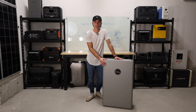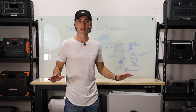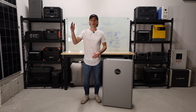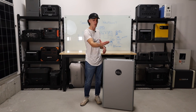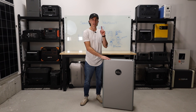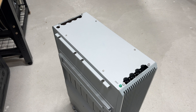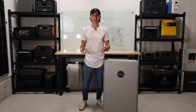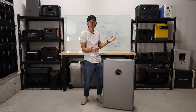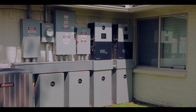When it comes to cons of this wall mount battery, the first one is that it is damn near impossible to move alone. It's 300 pounds and it's hard to move, period — which also means it's hard to install. Picture yourself trying to mount this to a wall, or getting it into your basement or up a set of stairs. If your solar setup isn't somewhere the delivery guy can drop a pallet and you can just slide it across the garage floor, you're not going to have fun. The next con is that you still need a conduit box that goes around the top. All your wires run up into that box so you can direct them somewhere else — it helps keep the system cleaner, but it's another hundred dollars per battery. It also renders them non-stackable on top of each other, so you'll end up running them side by side with conduit boxes on top, using a lot more wall space than you might have anticipated.